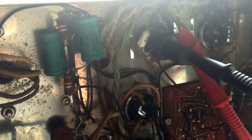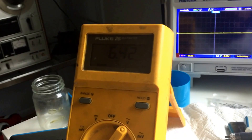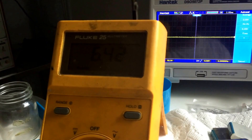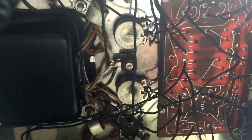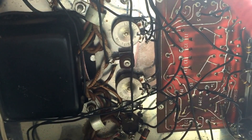I want to put in the other EL34s and see if I can get more of a voltage drop. I've got four EL34s in now and they're all running, one 7199, and voltage to the heater is still a bit high. I think that the rectifier tube — the GZ — plays a big part in some of the voltage drop, so I'm going to have to include that in the circuit once I've determined it's safe and see what the voltage drop is after that.